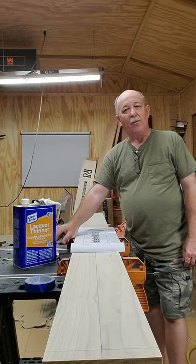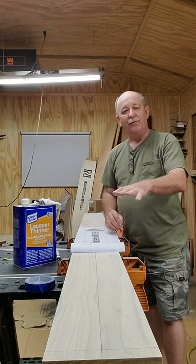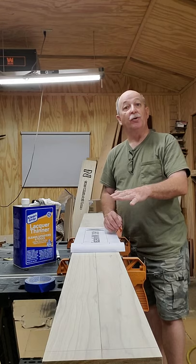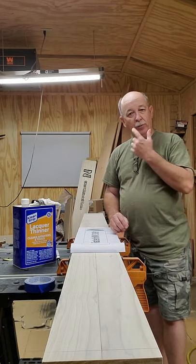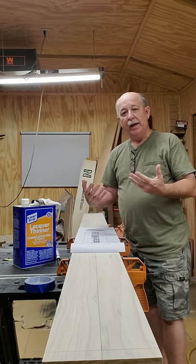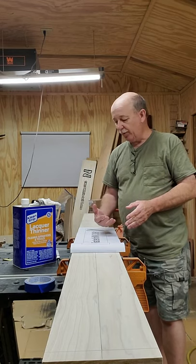To start out with, you have to get your board sanded smooth. I sand my surfaces up to 220 grit. Get it good and smooth, and your transfers will be a lot better, and you'll be happier with the image that you get to allow you to do your carvings with.